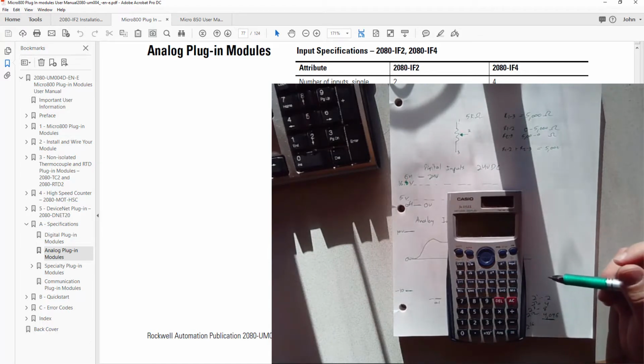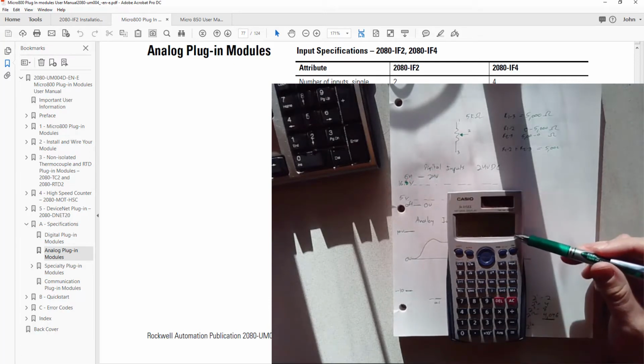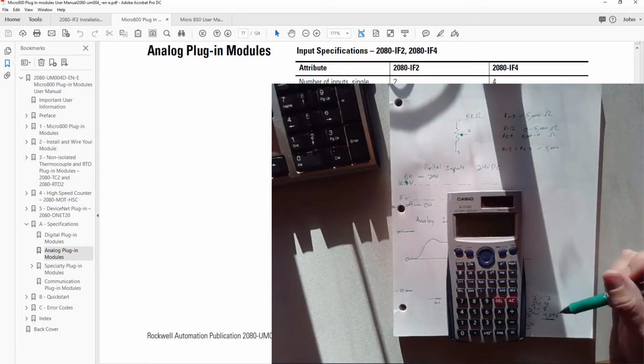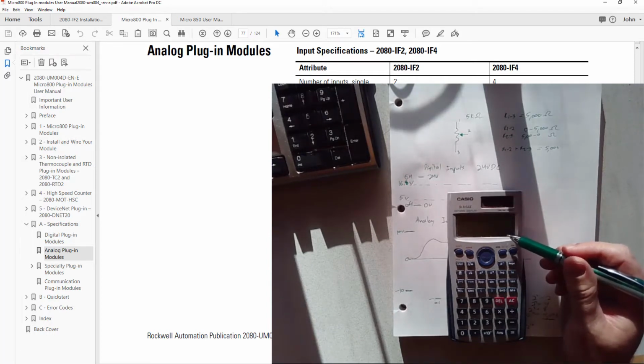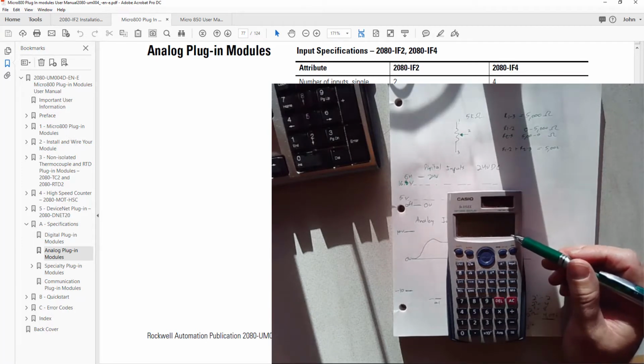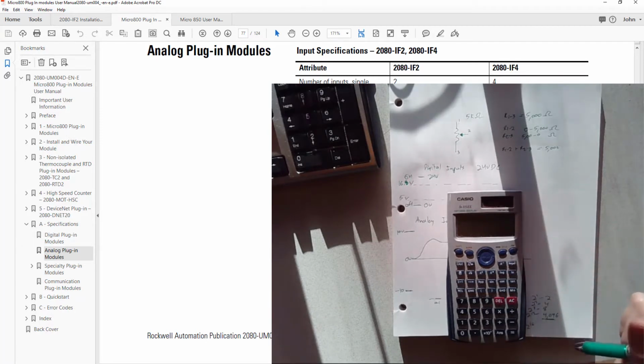So you'll see that when we actually connect up our sensor and wire it, the numbers will range between 0 and 65,535. But in reality, they're only guaranteeing the resolution or the accuracy to be 4,096. That doesn't mean just 0 to 4,096 out of that 65,000 is accurate, but it does mean that within that 65,536, it's only accurate to 1 part in 4,096. I'll explain that more as we look at the number later on.